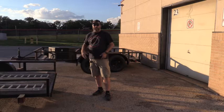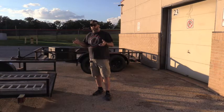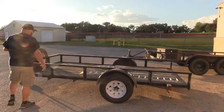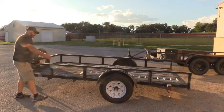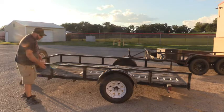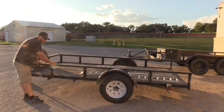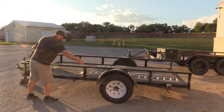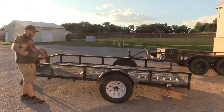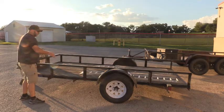They're not getting tossed in the back of the trailer, the back of the truck, in your way, or forgotten at home. So what we need to do first is figure out our capacity based on this trailer and where we're going to put the slides for the ramps to be stored. A common place is to remove the railing and make it part of the rails, but that doesn't work with this style — the most common utility trailer, which is an angle iron frame. The sidewall acts like a truss, so if you cut some of your framework out, you need to do a lot of reinforcement to the underside. So unfortunately that is not an option.